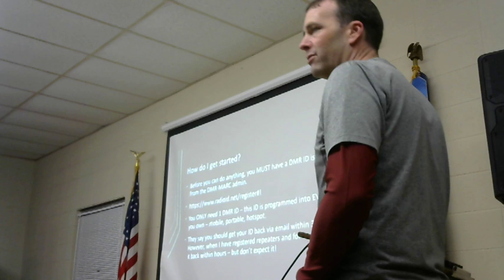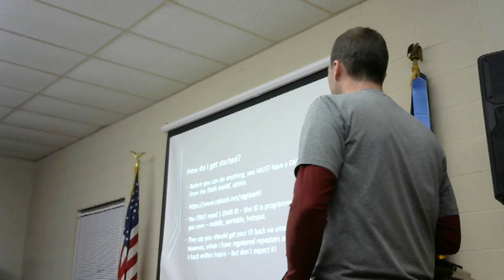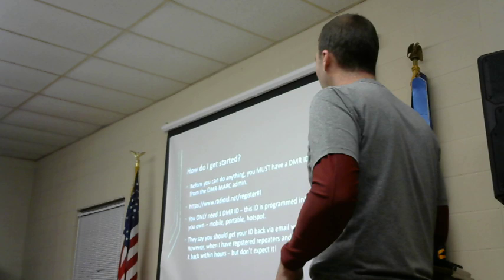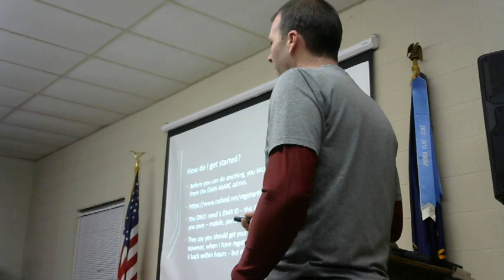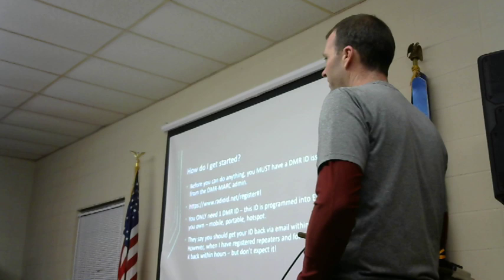You only need one DMR ID. When DMR first got started, people were getting a DMR ID for their mobile, their portable, their phone, the base station, and the trash truck they drive every day. Now you don't need that. You just need one. That's another nice thing: I have the same DMR ID for the hotspot, my portable, and my mobile. It's all the same. The reason for that is, in some radios you have to load a database into it, and whenever someone talks, it shows their call sign, what talk group they're on, all sorts of information, which is really handy if you don't recognize their voice or someone's deciding they want to be malicious and cause problems.